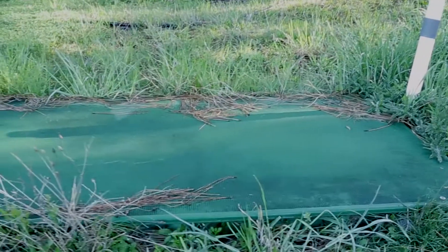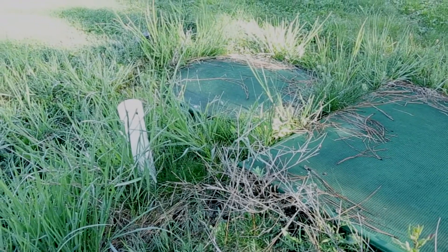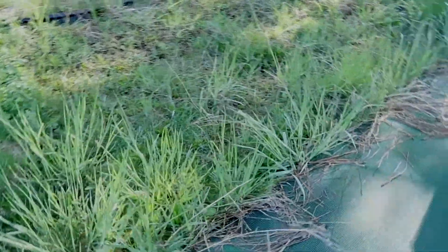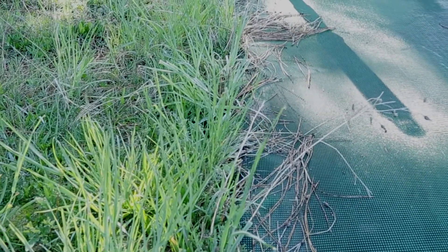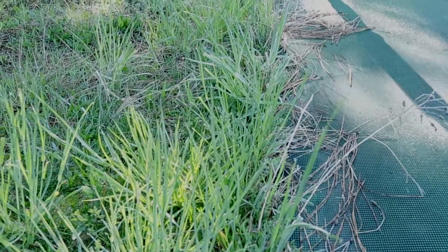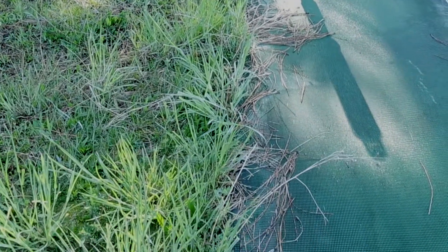Here at the Advantex unit, we've got a pretty good setting on the open edge — all the bolts are in place and the lids look good. There's a secondary vent on this side because we had venting issues before. The critical part is the backside edge: you want to make sure it's cleaned out and dug out, because if you don't have about four inches of drop to the native soil, when you open the lid it can jam into the ground or backfill around the Advantex pod and cause the hinges to break off — a pretty costly fix requiring new attachment hardware and re-epoxying.